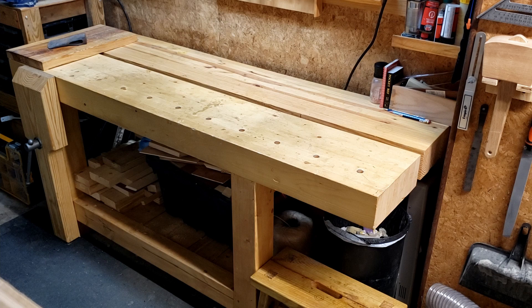Here is my short summary of pros and cons. Pros: Number one, the mass of the bench means it doesn't wander when doing robust hand planing. Number two, the strength of the joints means it doesn't rack or shake. Number three, the top is thick and makes for a stable work surface for chisel or plane work. Number four, incredible work holding — or as Chris likes to say, you can hold edges, ends, and faces. Number five, when using laminated lumber, it can be made inexpensively. Number six, durable — when the top gets marred or worn, you can grab a plane and reflatten it.